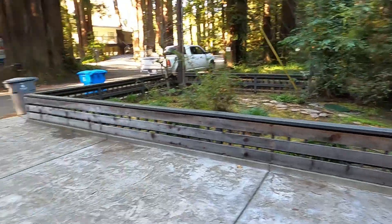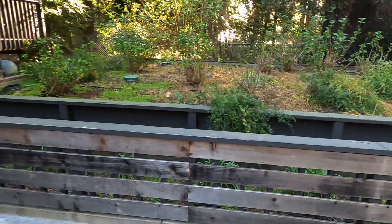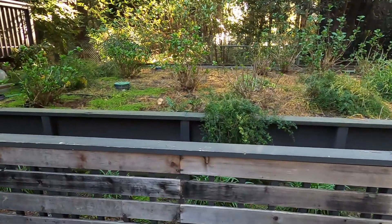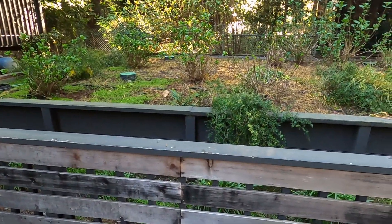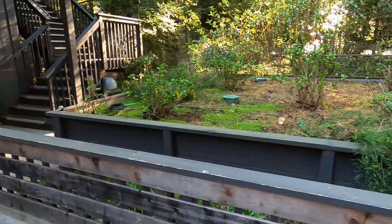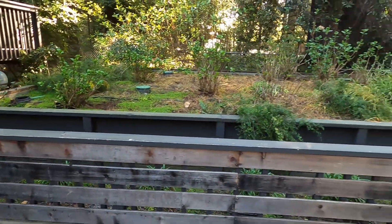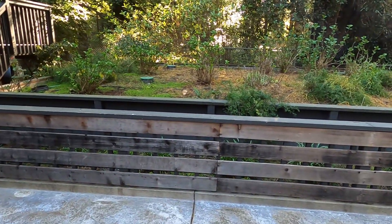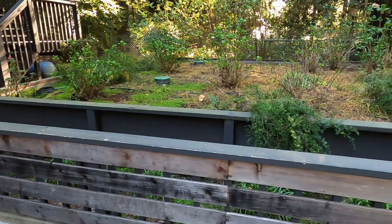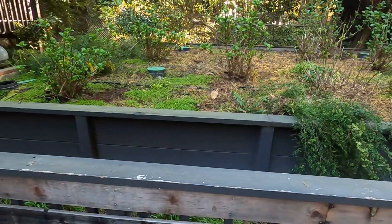Still waiting for a little more water to fill the sump tank. This is a bottomless sand filter. Sand filters are typically used where additional treatment is needed before wastewater hits the dirt or enters the ground, or gets close to existing groundwater. We are in a floodplain here so we have seasonally high groundwater. Sand filters are typically built on a relatively flat site, though I have installed them on some slopes. You do want the bottom to be level.